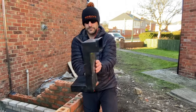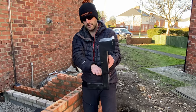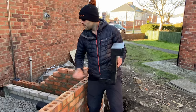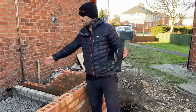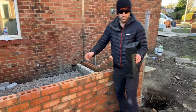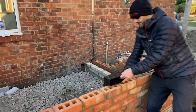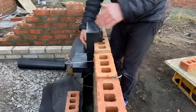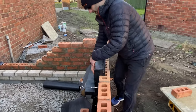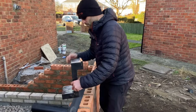Okay. So your air brick is here with a telescopic vent that drops down the cavity and across the inner leaf, and where there will be a pipe across here, it'll go underneath the concrete floor and ventilate the existing house. So we put a cavity tray in here, we'll show you that in a sec. But the whole point of this cavity tray is it's going to look something like that. So if any moisture comes down the face of this brickwork, it lands onto this vent, it's going to come down and transfer across, creating possible damp issues. So we need the cavity tray.